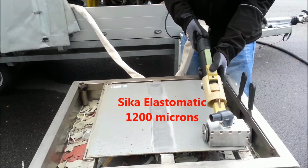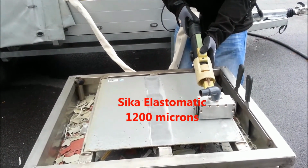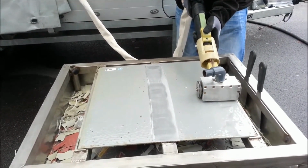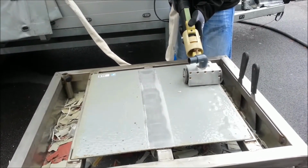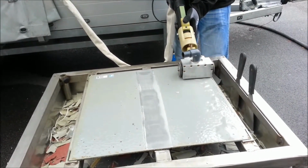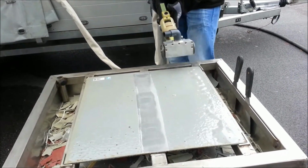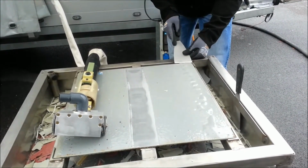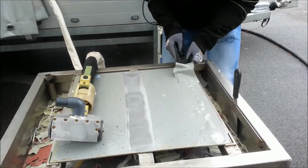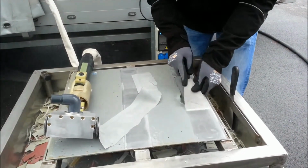Hydron Industrial removing elastomeric paint using RPR induction. The groundbreaking RPR induction technology utilizes induction heating produced from an electromagnetic field to allow the instant disbonding of materials from any steel substrate. Paint, passive fire protection, deck coverings, rust, and scale are all removed in a manner that is energy efficient, operator friendly, and more environmentally responsible than current conventional methods.